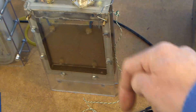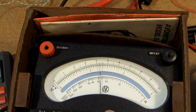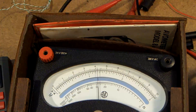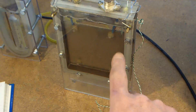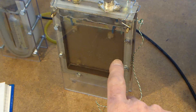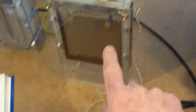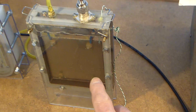Obviously that implies that the cell is actually trying to drive the power supply. So that's just the Avo across the cell — and the cell is holding a little charge. I'm very surprised about that, as it's only two plates that are 100 millimetres by 100 millimetres with a one millimetre gap. It's 316 stainless steel and the water is out of my dehumidifier. I want to do some work measuring the capacitance of the cell.